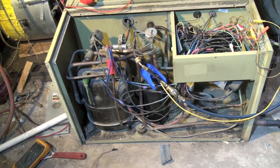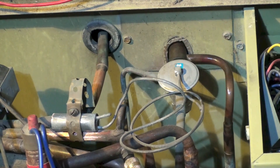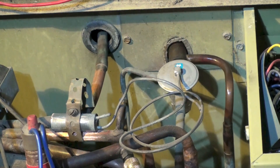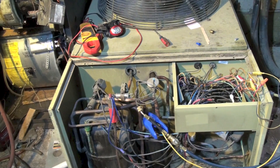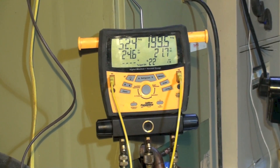I want you to tell me what's wrong with this heat pump. I'm going to go over some numbers, look at the gauges, and so on. First, this unit uses a TXV. Let's see if we can figure out why this machine is doing what it's doing. Looking at the duct temperatures: return air is 65°F, supply is 86°F — so we've got a 21-degree split. Now let's look at the gauges.